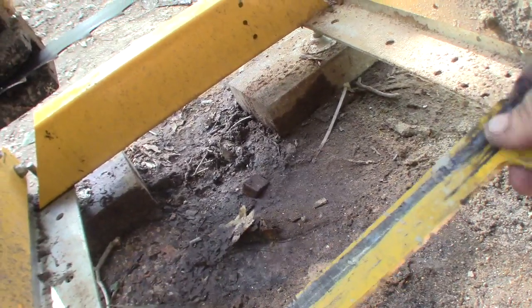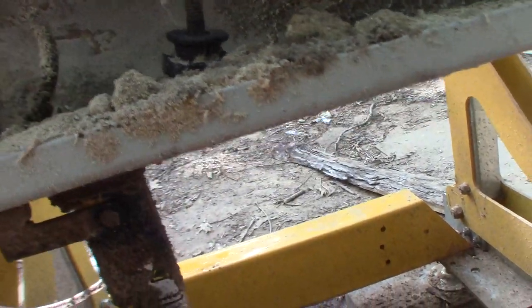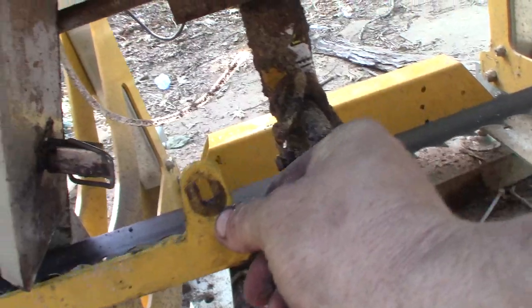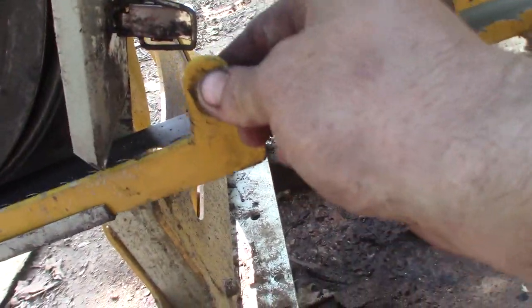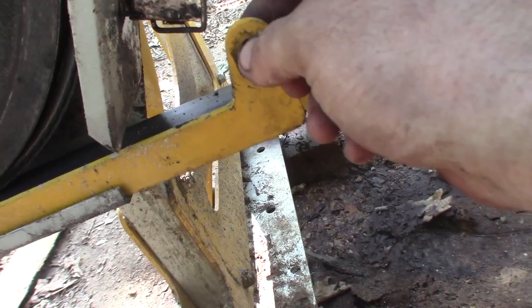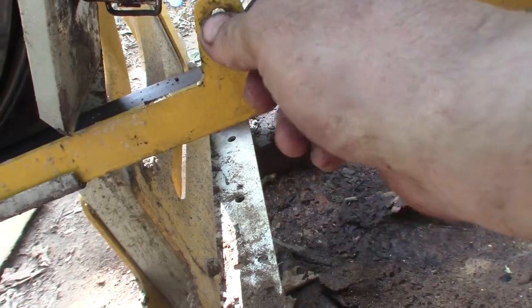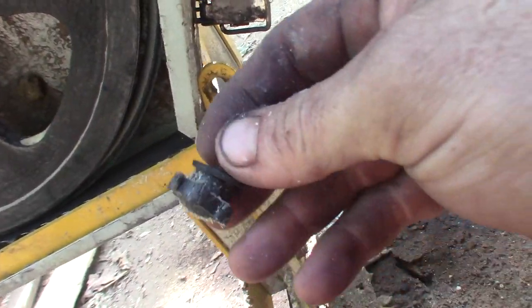But number one dislike right there is that plastic nut. I know it's meant to be for convenience and help you just unscrew that thing and get it out of there when you need to, but it will rattle loose on you and that thing will get to chattering, and it'll loosen out forward and that thing will tip and go right into that blade. So you really got to keep an eye on that right there. So I think that could seriously be upgraded and done differently.